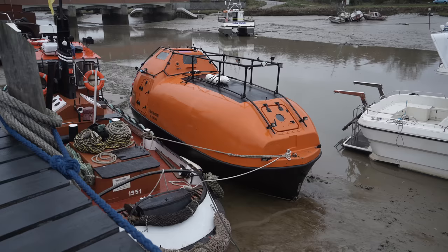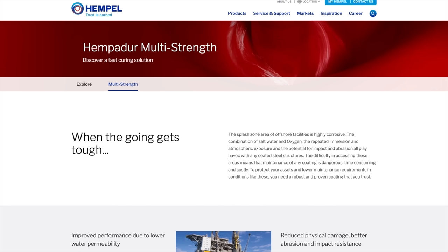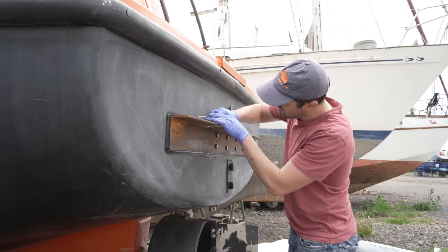I've made my choice. I'm going to go with a quality two-part epoxy below-the-water certified top coat. It's tough, we'll save on the hassle of maintaining anti-foul and it doesn't leach nasties into the water, although I will need to have it jet cleaned every now and again if in the water for a while.